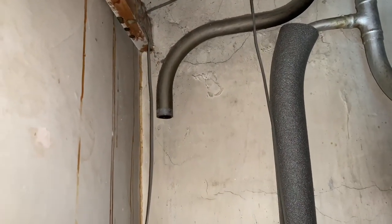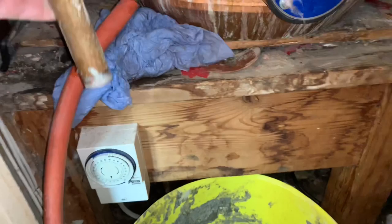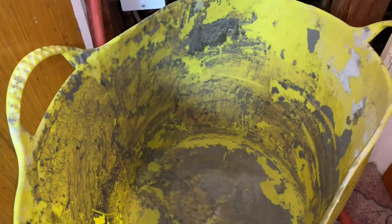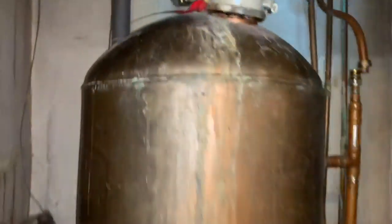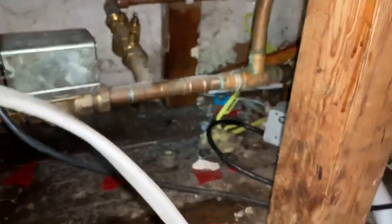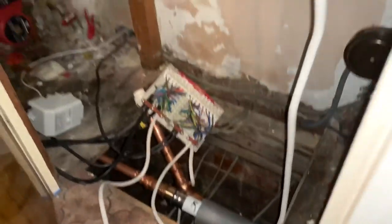So the cold feed into the cylinder I've cut off there. I've been draining the cylinder down from the drain off at the bottom, and just to make it a bit quicker I've just cut this pipe and I'm tipping into this tub here. Now I need to do that side there — that's the flow and return for the coil. Then I need to disconnect that top there — that's the hot water outlet. Then we'll remove and lift the cylinder out and get to our S-plan. There's our S-plan plus under here, so we can get to all that and then connect it into the new system out in the garage.